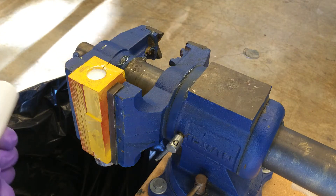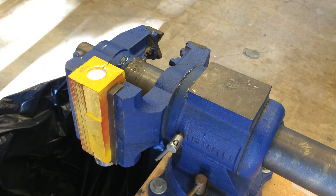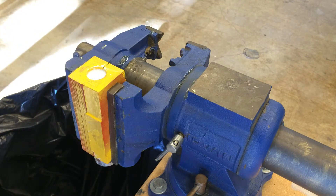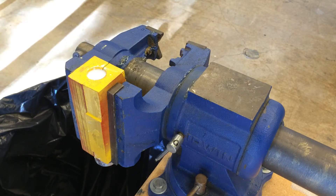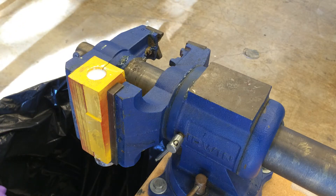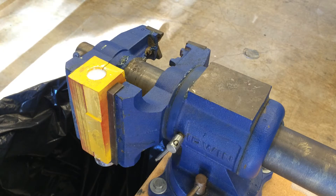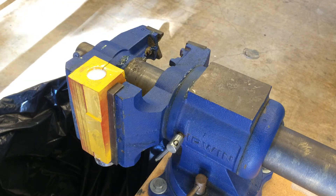There are a couple of ways I could do that. First, I could put a taper on the core pin — that would cause the vacuum to get released very quickly. Setting up our lathe here at TechShop to make a taper is a little bit tricky, and making tapers on lathes in general is tricky especially for a long part like this pin. That's an eventual improvement we can make, but I don't have that at the moment.